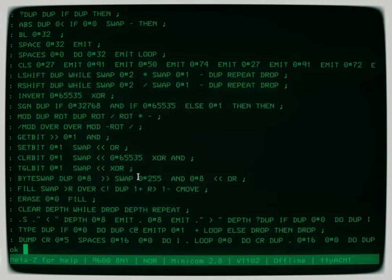It works just like my actual hardware, except faster with the 9600 baud terminal. And then on top of that, you've got a clock speed of somewhere around 80 or 90 megahertz. Now, of course, the emulation eats up a lot of that, but if I do a test mem, for example, that pretty much runs about, I'd say, 10 or 15% faster than my actual Membership Card running at something like 1.8 megahertz. So roughly like a 2 megahertz 1802.